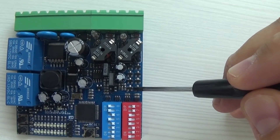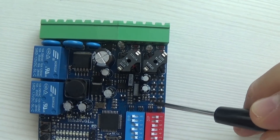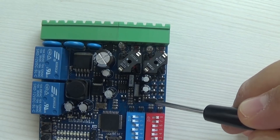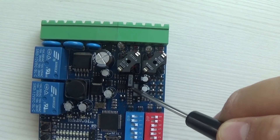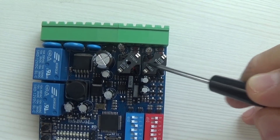Then we have a multiplexing circuit here with eight transistors, PNP. And this little transistor here is forming an oscillator with these two capacitors and these two transformers.